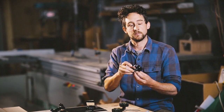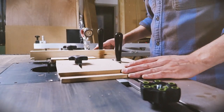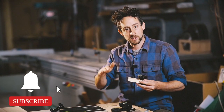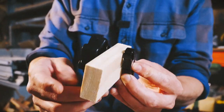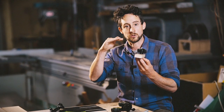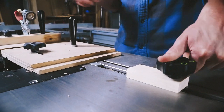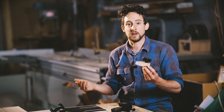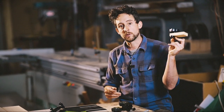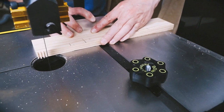If you place one of these — the small miter locking device rather than the long bar — into the miter slot, you can use it with a coping jig that runs in the miter slot to set the depth of the cut you want to perform, if you didn't want that cut to go all the way through. If you need that depth stop to sit above the table rather than just in the miter slot, you can put a little chunk of timber on there, giving you the ability to place a depth stop on top of the work surface. This is useful on a router table — you might use it when you couldn't use the flip-down stop on the fence, or it was getting in the way. Put it in the miter slot, move it wherever you want, and lock it down. This applies equally to a bandsaw or table saw.